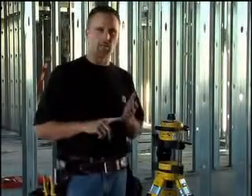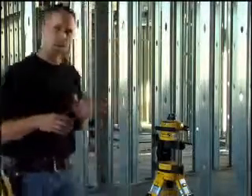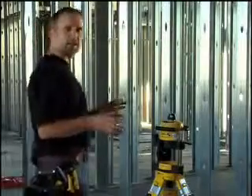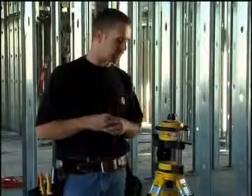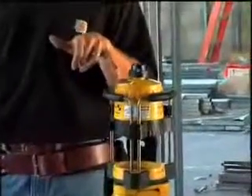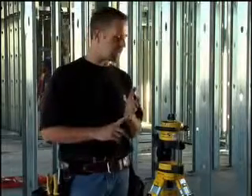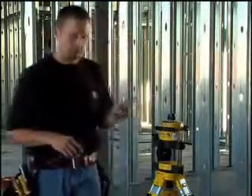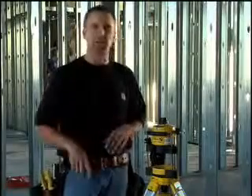The reason why we want high alert is if we were on a big job site and we were far away from this laser, and somebody were to walk by and accidentally kick the tripod, this laser is going to tell us because it's going to shut down completely — it's not going to turn back on. So as soon as that laser light goes off — right now, the Y-light went off. What happened is this laser locked into high alert, and it's a default setting. Every time you turn this laser on, it wants to go into high alert. If somebody were to come by and kick the tripod, you can see that the laser actually drops down lower and shuts down.